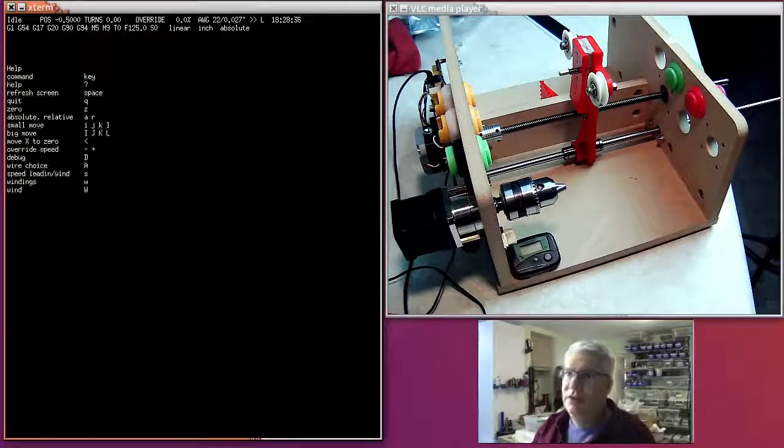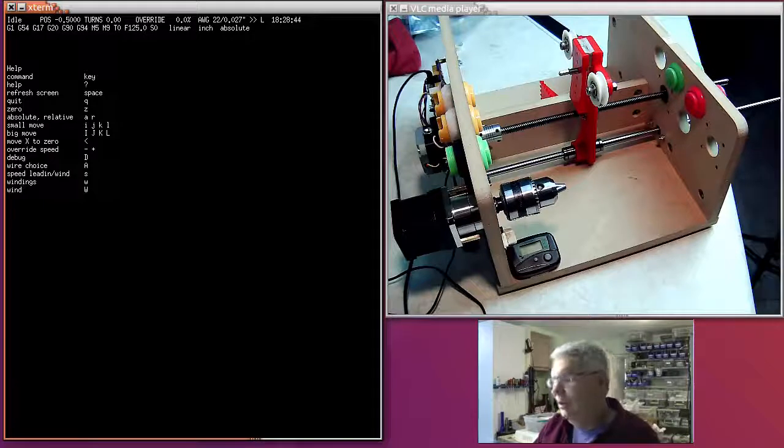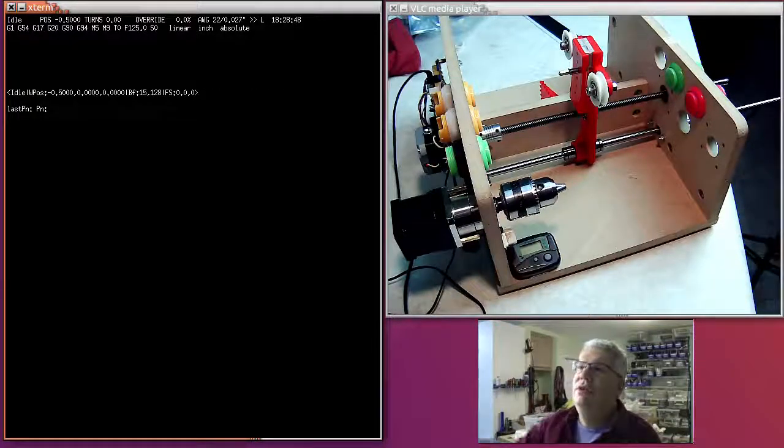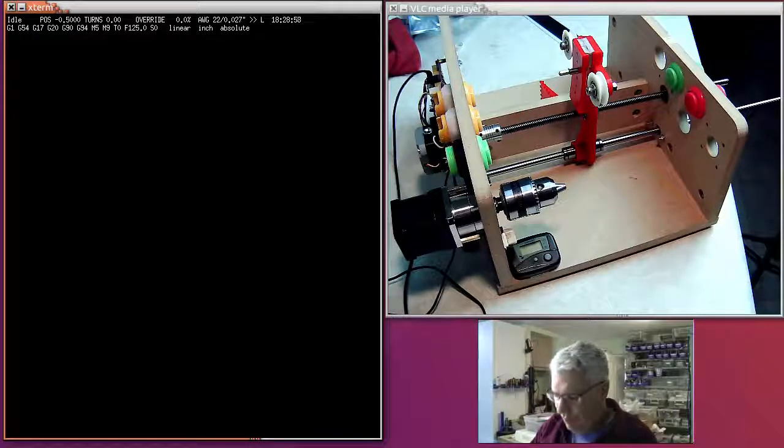This is a simple text interface that runs in Python. If you hit a question mark it shows you the keys — the help menu. The first thing I can do is a capital D for debug, which shows you down here the stream of status messages coming back from GRBL. I'll go ahead and turn that off. From here I can jog from the keyboard or from the actual machine buttons.